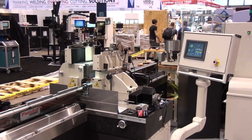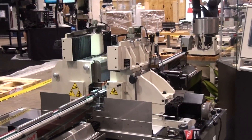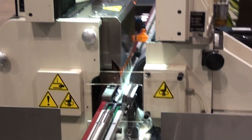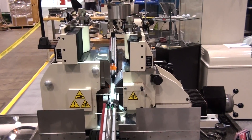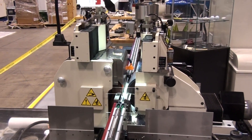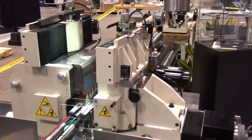The grinding wheel spindle design has three sets of class 7 ABEC angular contact Timken bearings inside a larger headstock with an outboard self-centering bearing set for a twin grip design. This design gives the grinding wheel spindle superior accuracy.